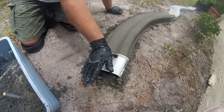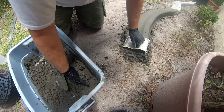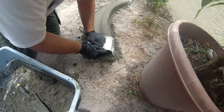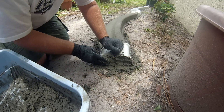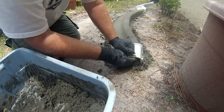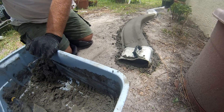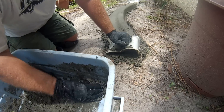I'm going to start initiating my turn out. I'll just turn the form, start turning the form the direction I want it to go. You can see the form is now turning. Adding concrete — usually in a big turn or a tight curve is where you're going to have more difficulty. You'll need more concrete into the backside of your curving trowel.